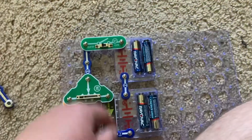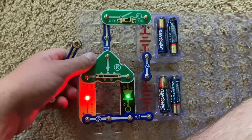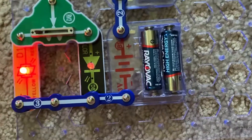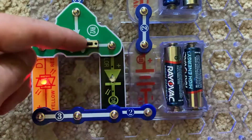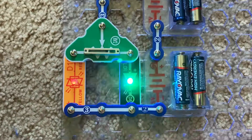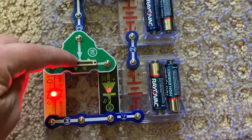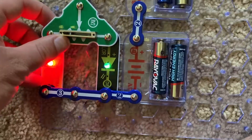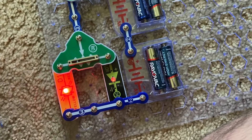Project 133 is current director. I'm going to turn on the slide switch, and when the adjustable resistor is on the left setting, the bi-color LED is on red and it is very bright. The color LED is on and flashing, but it's much dimmer. Now I'm going to gradually move the lever on the RV2 to the right, and now the color LED is brighter. Its current is controlling that through the bi-color LED so that both are now flashing. The color LED is now getting the most current. Slowly move the lever back to the left, and the bi-color LED gets the most current. The RV2 has a total of 10,000 ohms between the center and the two sides, and moving the lever will distribute the resistance to either side.